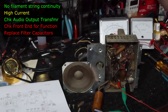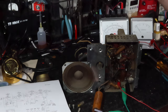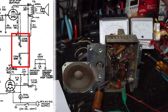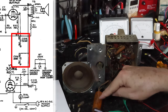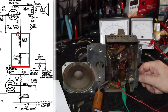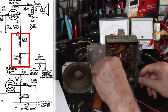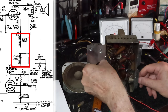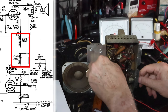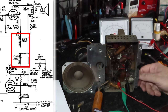100 volts. We're just under 0.2 amps. 110 volts. 0.2 amps. We have hum. That's from the red capacitor. It's still in there. So the audio circuit's working. Now I don't have an antenna hooked up. Let me see about hooking up something to that. But we got noise. We got hum out of here.